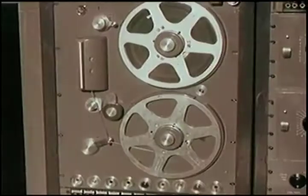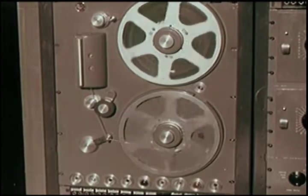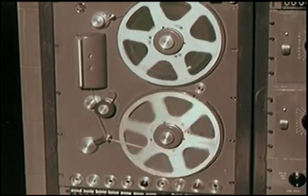Everything's set, and a coarse pitch lead-in groove is cut to the music area. The tape machine is started, and exactly 1.5 turns before the music begins, the cutting head automatically changes from the lead-in groove to fine pitch music grooves. The cutting stylus is a minute piece of sapphire, perfectly ground and electrically heated, so there is virtually no resistance as it cuts into the smooth lacquer.